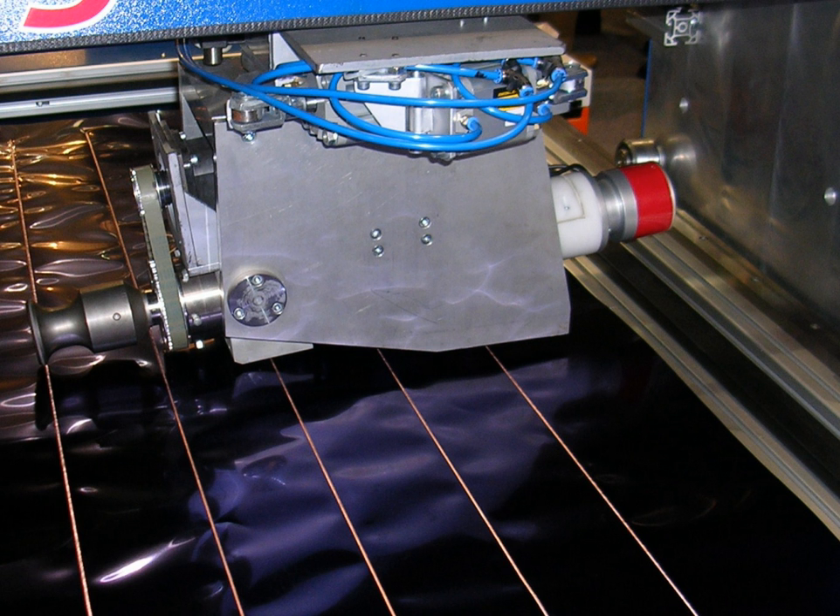For joining complex injection molded thermoplastic parts, ultrasonic welding equipment can be easily customized to fit the exact specifications of the parts being welded. The parts are sandwiched between a fixed-shaped nest and a sonotrode connected to a transducer, and approximately 20 kHz low amplitude acoustic vibration is emitted. Common frequencies used in ultrasonic welding of thermoplastics are 15 kHz, 20 kHz, 30 kHz, 35 kHz, 40 kHz, and 70 kHz.